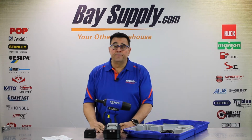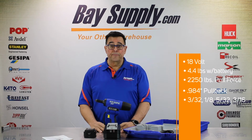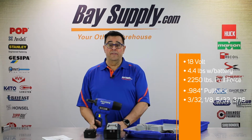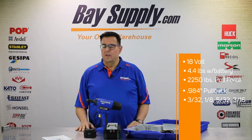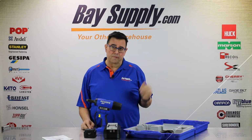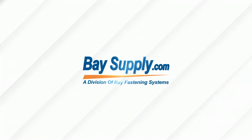Let's go through some of the specifications. As I said, it's an 18-volt system. It's a 4.4 pound weight with the battery on the tool. It's 2,250 pounds of pull force, so it's a mid-range tool designed for pretty much standard blind rivets from 3/32, little tiny rivets, all the way up to the 3/16 diameter rivets. Let's set some rivets and we'll go through and show you how it works.